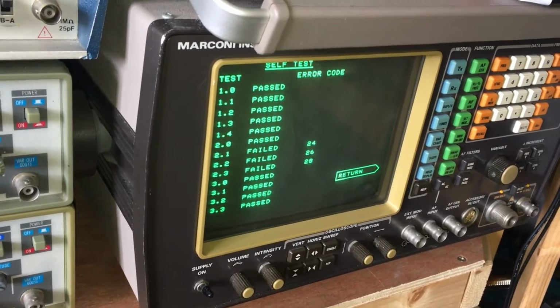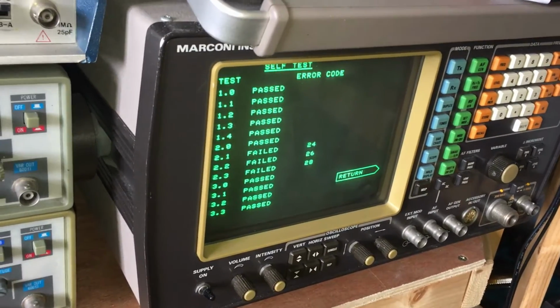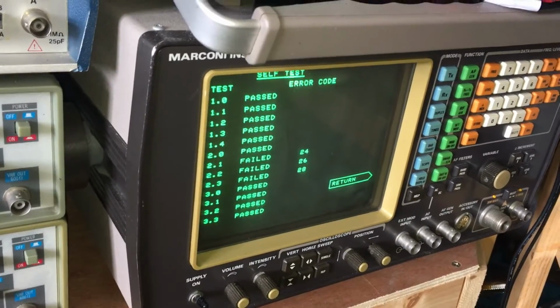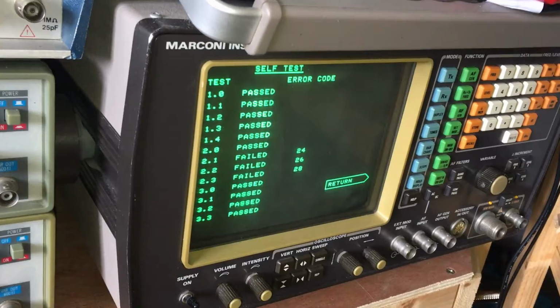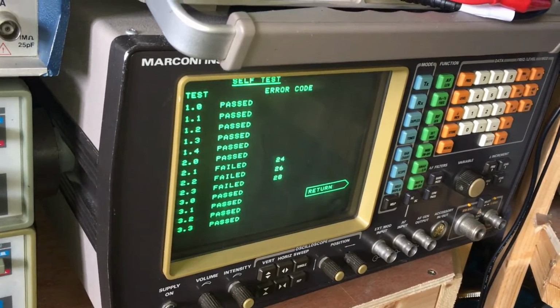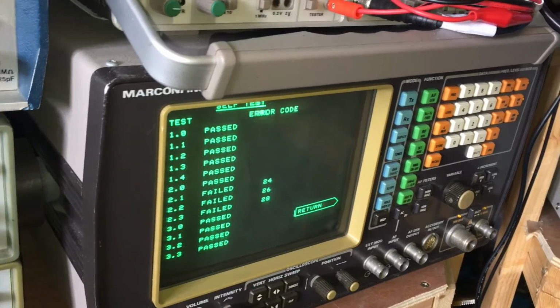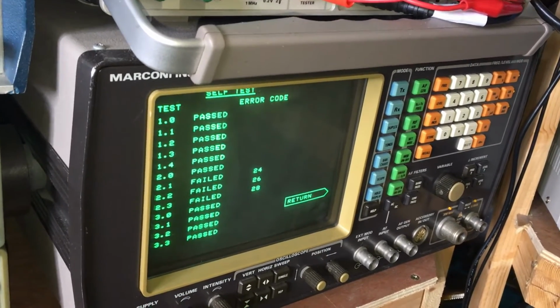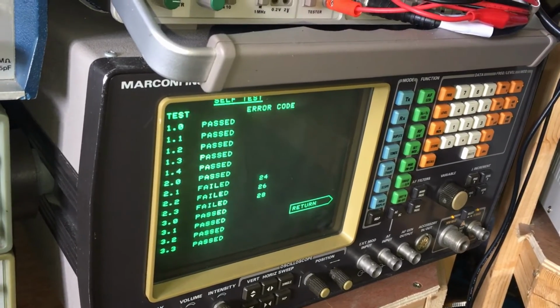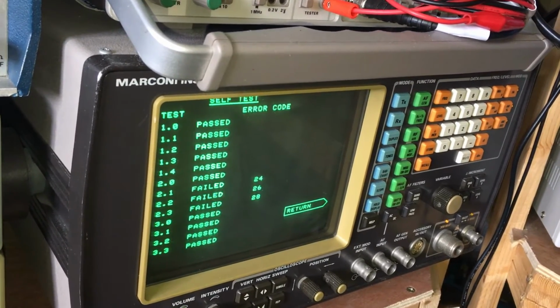But what I have found is if I connect a radio up to it, run a transmitter test, just give it a couple of keys on the mic, it will pass straight away. So it's obviously drawing something in there, is heating up, and once it heats up it comes back into spec, so it's slightly off the spec. And it does read slightly low on the frequency, it does read slightly low on the power.